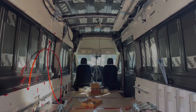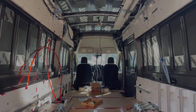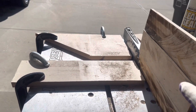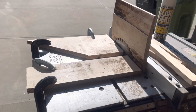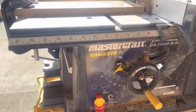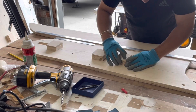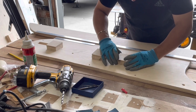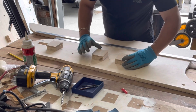The upper part of the wall has a reclined angle — I measured it at about 5 degrees. When making the upper wall base spacers, I cut them with a 5-degree angle to make the spacers perpendicular to the floor. Similarly, the frame panel on the floor roof also has an angle of about 8 degrees, so I made 8-degree angle cuts on those base spacers to compensate.